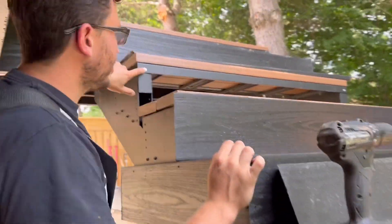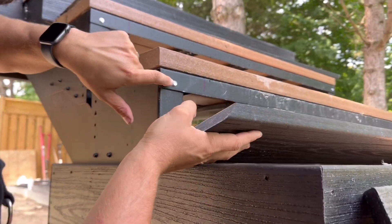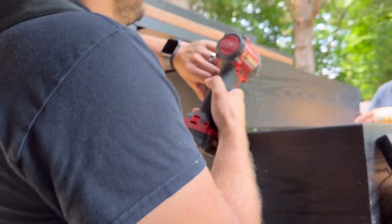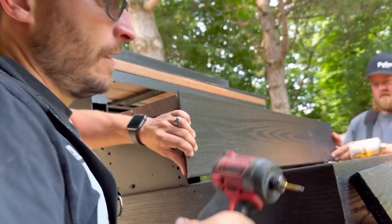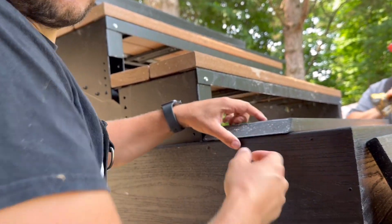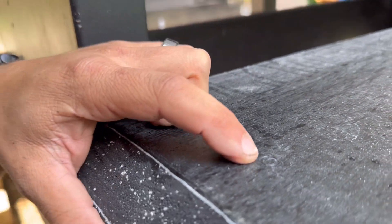Here's how we address the issue of these screw heads that are sticking up. We'll put the riser on roughly where we want it and then give it a smack. It doesn't have to be perfectly accurate, but you'll see it leaves a dimple in it. Come over here and check this out — you see that little dimple? That's your easy mark.